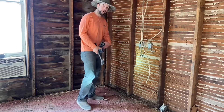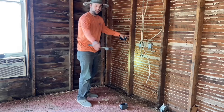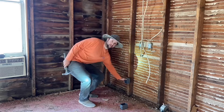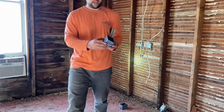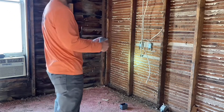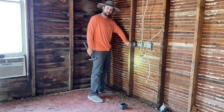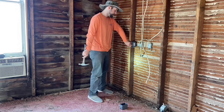Find where you want your boxes first and go ahead and put your boxes there. I'm going to set one on the ground right here. What I'm thinking is a lot of people laying in bed use their phone or want to plug their phone in at night. So instead of putting a plug way down here at the ground, I'm going to put a plug up here. There are these little lines on the side of the box and that acts as a guide — all you do is put it right up against the wood, like this.